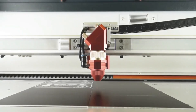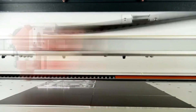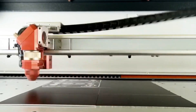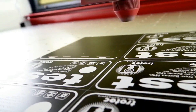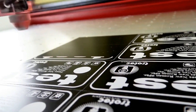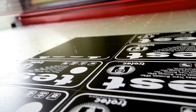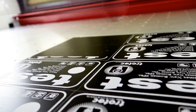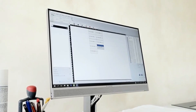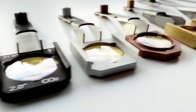Sometimes it's difficult to see if what you're engraving is truly out of focus. It could be the case that you don't have enough power, but please be aware that materials can react very differently. On anodized aluminum you are vaporizing the anodization of the material, in contrast for example with plastics where you have a melting process occurring. This means that if you use too much power the engraving may blur things out, or if you don't use enough power it may not penetrate the surface properly and it may look like you are out of focus. Understanding the parameters in job control, experience with different materials, and the use of different lenses are rather important to quickly determine whether you are in or out of focus.